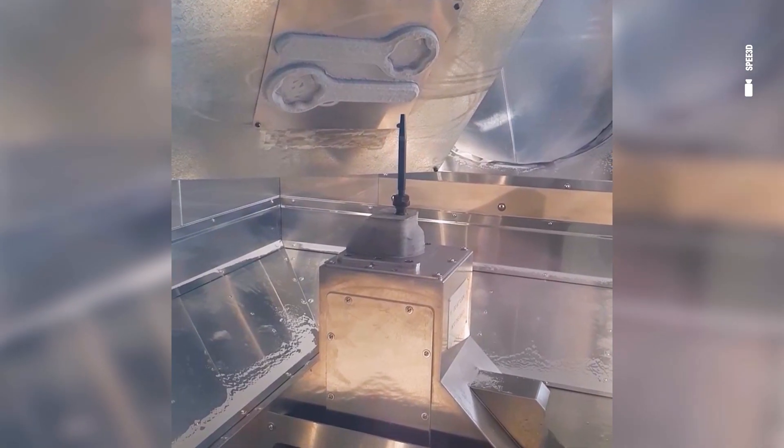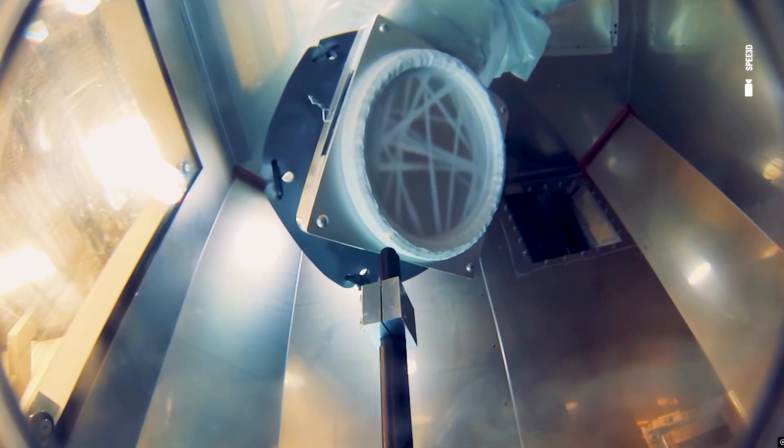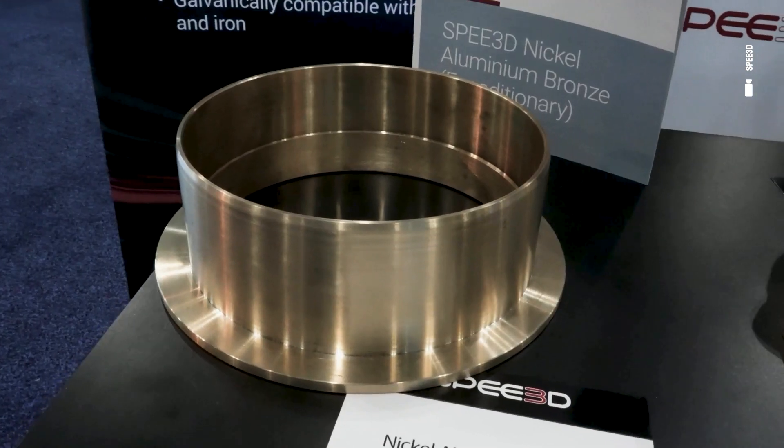You need to do some heat treat to anneal the parts and some post-processing, because the spraying — while shockingly precise, especially with the new phaser nozzle — is nearly but not quite as precise as a laser melting particles at a 50-micron spot size. So rather than starting with a stock piece of metal that you might have to cut 50–60% away, you can start with a near-net shape that's 90% where you want to get, and now you're only removing and surface finishing a very small amount.